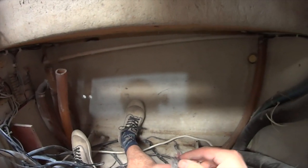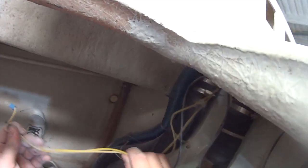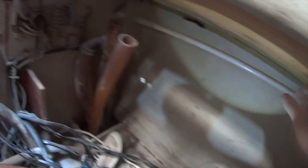I know now is not the right time to be going on about this, but it just amazes me how there's wiring everywhere and it's all just a mess. There's a red and a brown going nowhere — this is the old engine loom for the Volvo Penta which they couldn't be bothered taking out when they changed it over to the Yanmar. It's just spaghetti everywhere you look. Anyway, best not to get too worried about it. I'm here to try and dry out this area and suck the moisture out of this last bit of core in the toe rail. I'll just cut away some of these hoses that are making it hard to get in and out — these are the vents that go from the water tank. I've just drilled a heap of 8mm holes in the underside of this skin through into the old core in the hope that this will help dry it out.